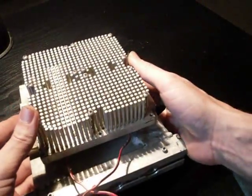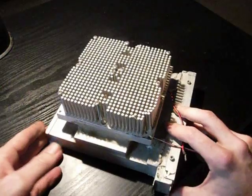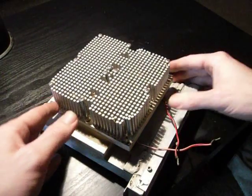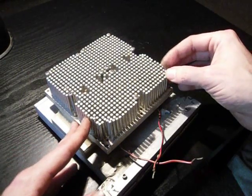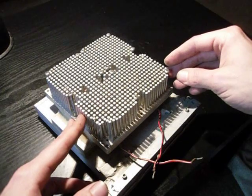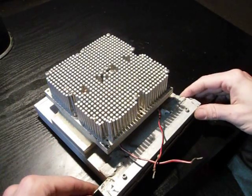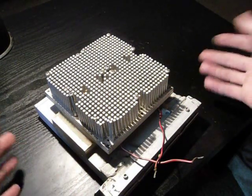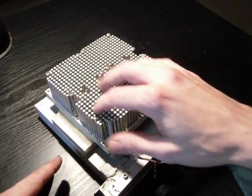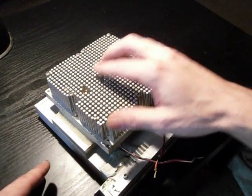The main thing is this heat sink. We worked with a heat sink company to design this, and it was designed to offset a hundred watts of heat and not raise more than 10 degrees from ambient temperature. So in cases where people might be thinking of using Peltiers as thermoelectric generators for power generation, it might need to be a pretty big heat sink if you don't want a large temperature change on your other side.